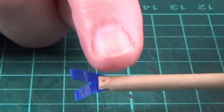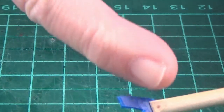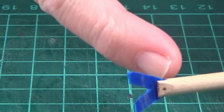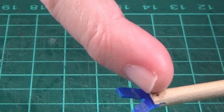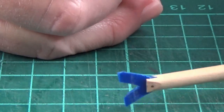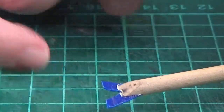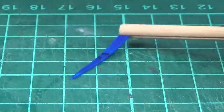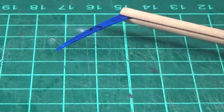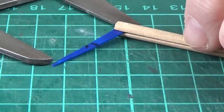Also, it's double-sided. On one side, I've cut it off square so that it's got a ridge on this side, which actually catches on the link as it goes down, whereas the other side that's against the magnet is smooth and tapers down towards the plastic so it can slide past the magnet. On the other end, I've just made a skinny, pointy, triangular shaped piece of plastic that's, let's see, how wide is that?